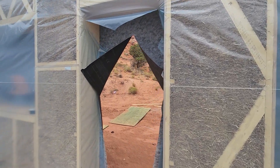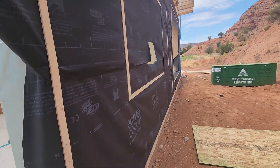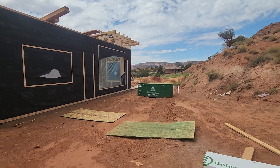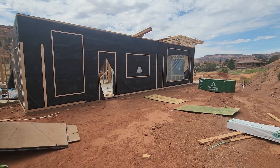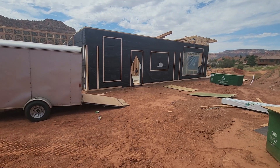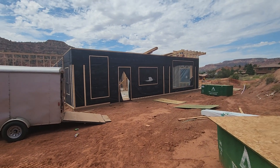So far it looks really pretty nice. The framers think they can do this faster with regular materials — sure, if you're doing a two-by-six wall you can frame that a lot faster. But this is essentially what we'd call a double wall system with an air tightness layer and insulation layer inside of it.